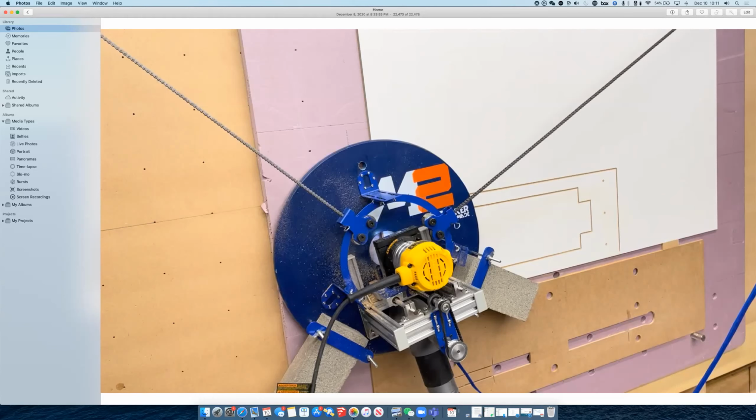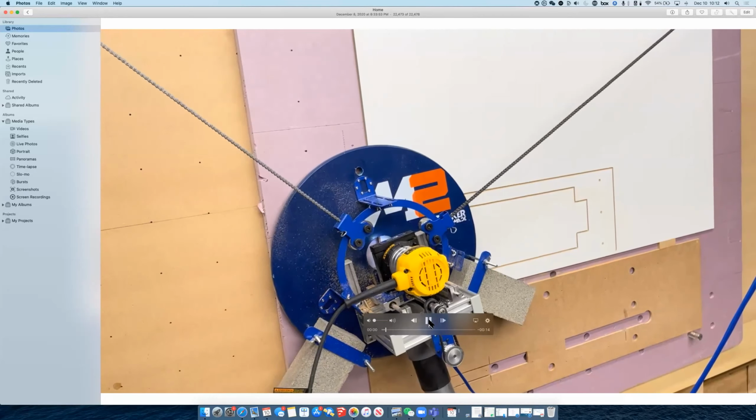Oh yeah. So a trick that I use, and we're still testing it out just to see if, one, is this a product that people want, or two, is this just a thing that I came up with that helps me? On my waste surface, I have a similar grid that I have drawn out. My squares are a little bit larger, just to fit the use case. And then in my grid, I drilled them out to, I believe, 8 millimeters. And I have aluminum threaded inserts screwed into all of those holes.